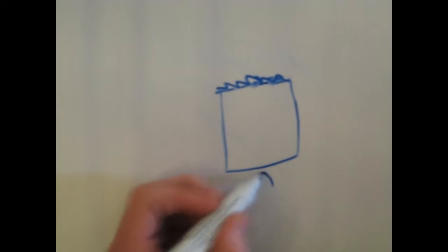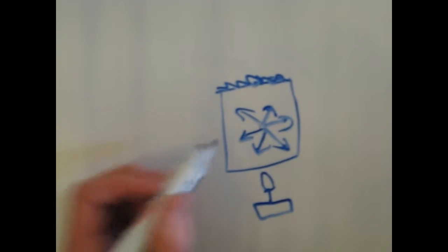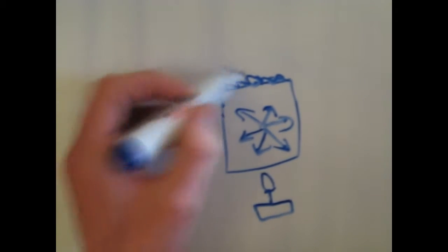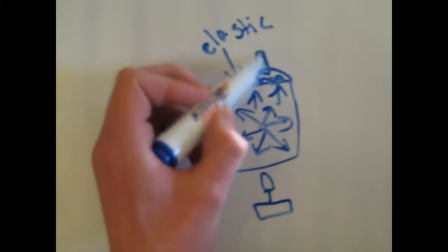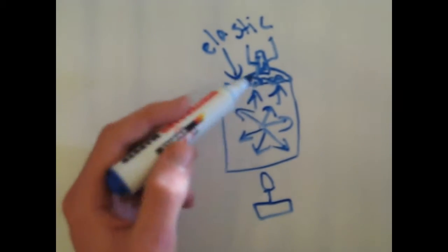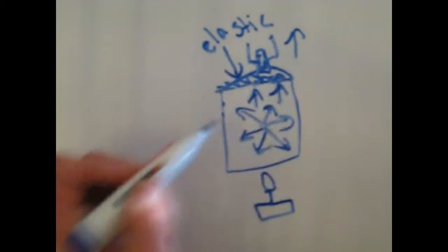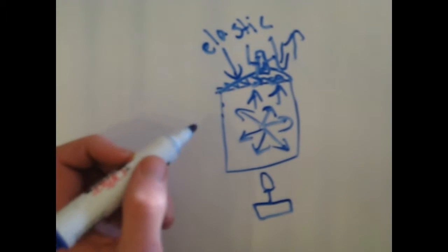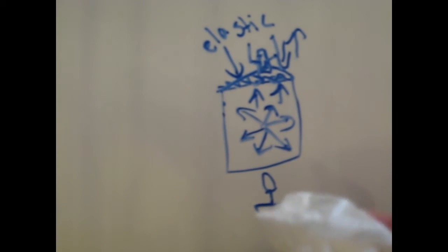The second property is that as the gas is heated up, it also expands. Now, the walls of the aluminium can won't exactly expand, however the elastic balloon will expand, and this is exactly what moves our Stirling engine along. As the air is heated up, the balloon is pushed upwards with the bolt on top, and this helps turn over the crankshaft of our Stirling engine. As the air is cooled, it shrinks back down and pulls the balloon back down with it. This also helps turn the Stirling engine over.